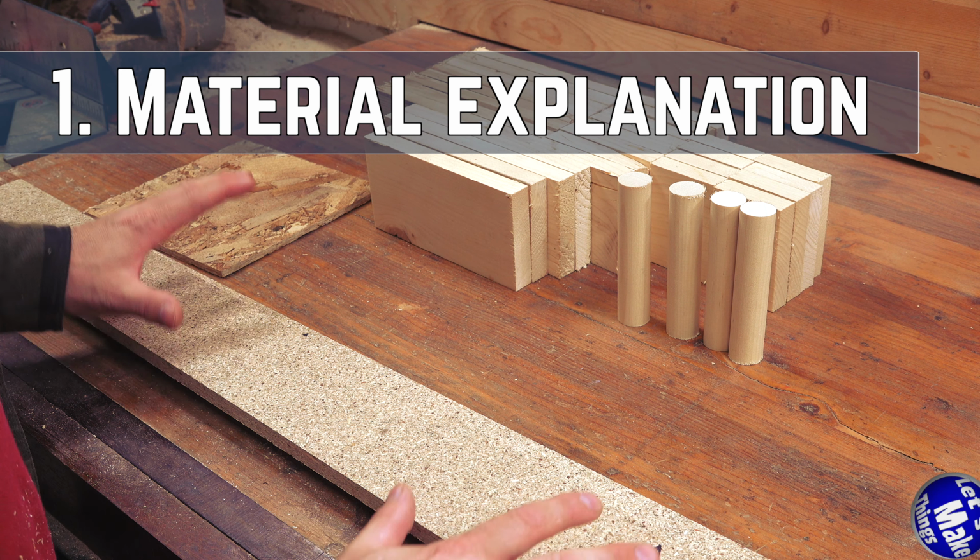I've gone ahead and added my screws, just a couple at least for right now, and it fits in there really well, fits inside the tray. So I'm going to go ahead and detach it again and then glue the plate on. Before we glue, we want to make sure that we sand the edges just a little bit to prep the wood. Really important that we do this. Otherwise, the wood will not accept the glue. Besides that, we also want to make sure that we sand the part that's going to be glued to the bottom, which is this piece here.